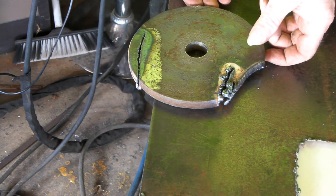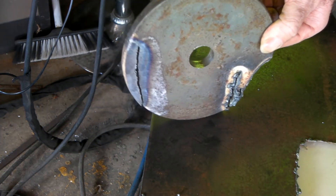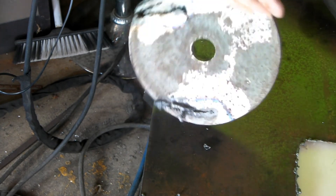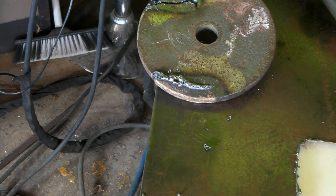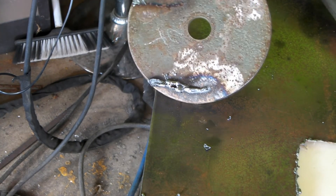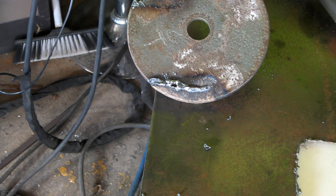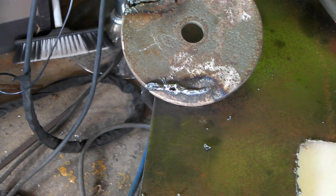So that wasn't really that successful guys. It's hot — ow Pete, that is hot. But it's ugly. Look at how much dross is on there. It's not even severing it completely. It just doesn't seem to have the grunt. And I can smell burning plastic — might be that extension cord. Let's have a look at that guys.